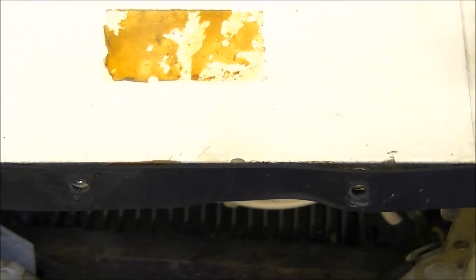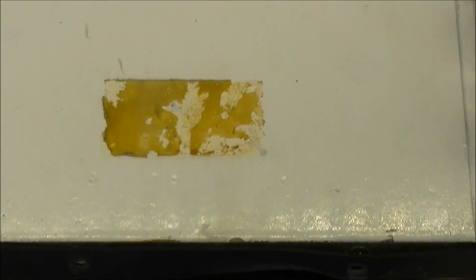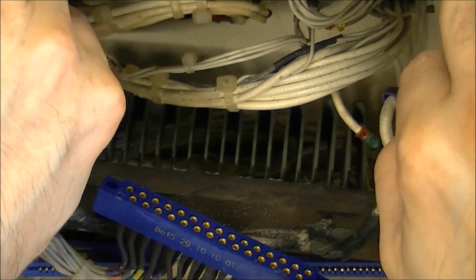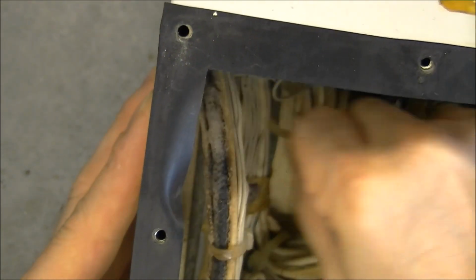One thing left, but it will not really be easy to show you here at the back. Do you see this? On this bakelite piece we have what seems to be a big giant current shunt. Big wires at each side, so it must be something the current comes through, but obviously it did not sense well enough to tell the system we had an overcurrent condition, and more melted zip ties.